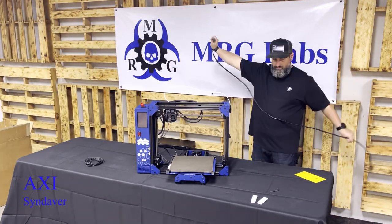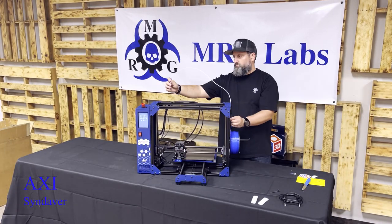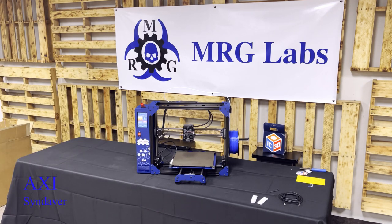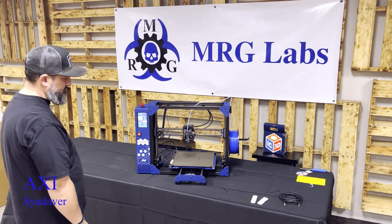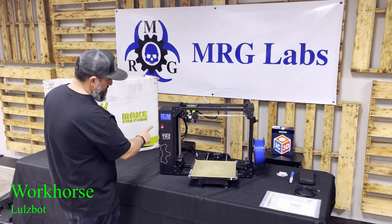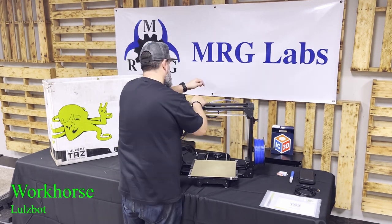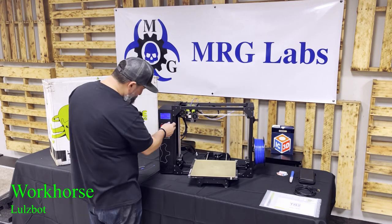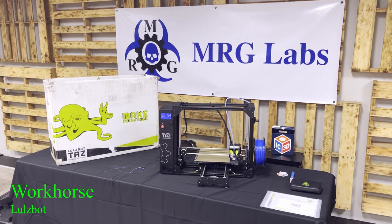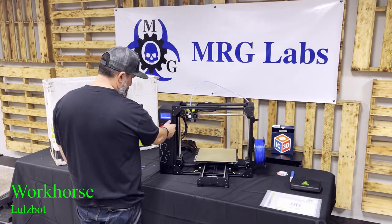Next on startup: now that we've given you a rundown on the differences between the features of the printers, I'd like to continue pointing out the differences during startup. When you turn on the Axie, the Z-axis moves to the top of the print area and the tool head goes to a ready position. The Workhorse runs a nearly identical process upon powering on, although it does have a different tool head ready position. The Workhorse uses the sequence to level the X-axis, and unfortunately leaves it in a potentially not-so-level position relative to the bed. At this point, you can access options on either printer from the menus. If you aren't printing directly from the computer — which is possible on both printers, although I don't recommend it — you can select the model you want to print from the list, either from the USB drive on the Axie or from the SD card on the Workhorse.